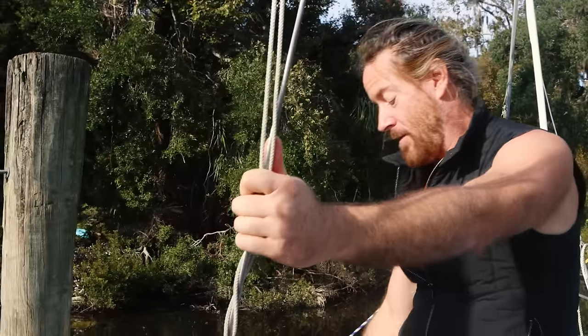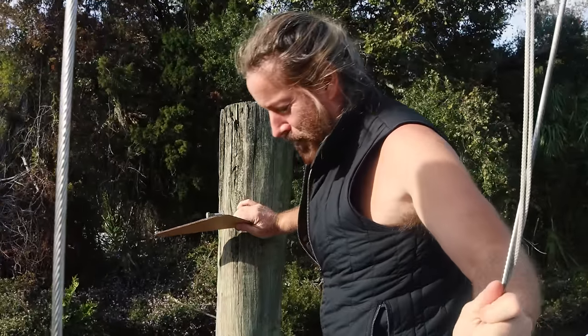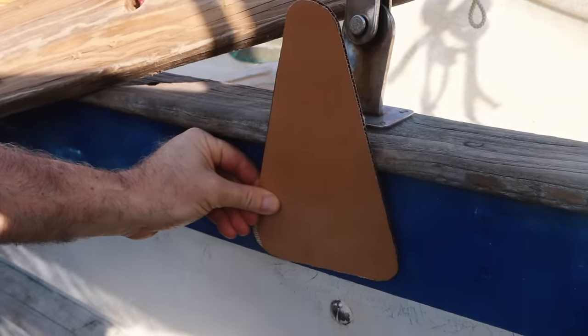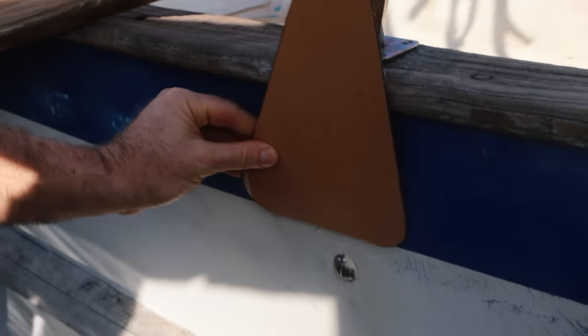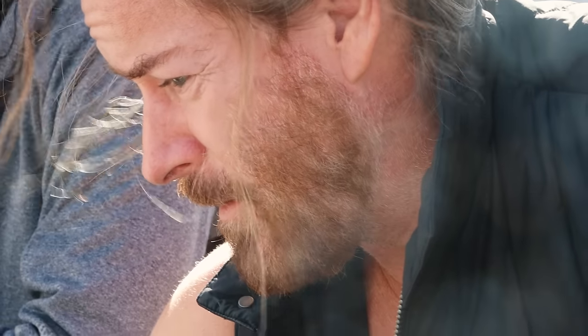This is a big project that I have been dreading. So the point is, we don't want to change them because we have to tear out all our furniture and grind fiberglass for weeks. We live in the boat, man. Engineering wise, Helen wants me to go through this with you carefully because she trusts your engineering. And what it allows us to do is to put a fifth and sixth bolt through the gunwale all the way through to a backing plate. And then one more bolt, it'll just drill right through the existing strap. So that compressive load is more forgiving than these tensile loads.